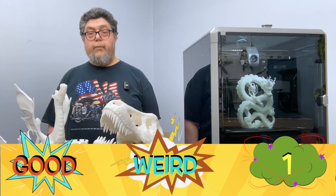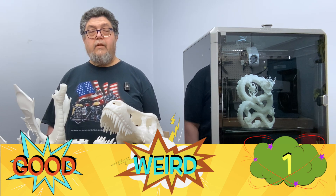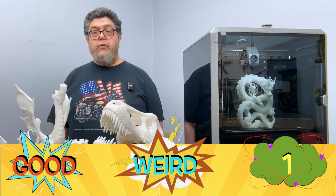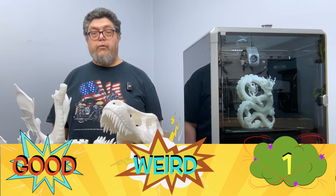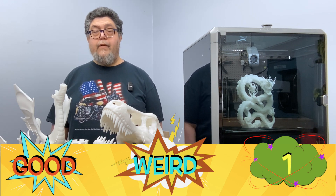One of the more noticeable aspects of the K1 Max is its speed. This printer is capable of a 16-minute Benchy. The pre-sliced demo version printed at warp speed compared to the 41 minutes it takes using Creality Print's default settings. I asked ChatGPT to analyze both G-code files, and the AI concluded that the faster version uses a 0.25mm layer height instead of 0.2mm, and feed rates reaching up to 14,400 millimeters per minute, compared to typical speeds of 2,400 to 3,400 millimeters per minute. Even using default settings at 42 minutes, the K1 Max beat the Anycubic Cobra 2 at 58 minutes, the $7,000 Ultimaker S5 at 59 minutes, and the older Ultimaker 3 at 67 minutes.